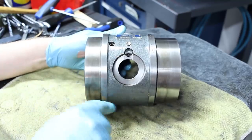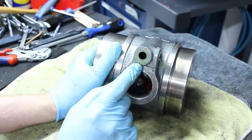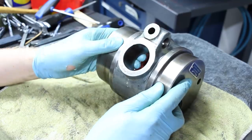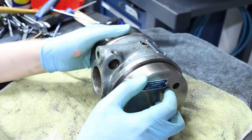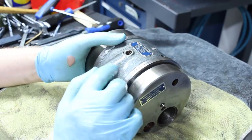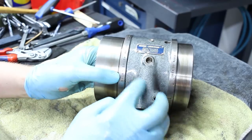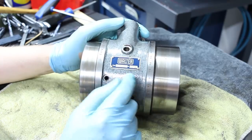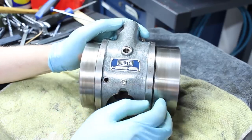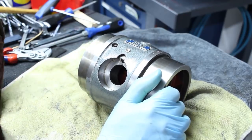The casting cleaned up nicely. The paint looks okay — I'm definitely not going to repaint this. What's odd is there's some green on here, some Reseda green, RAL 6011. Either the undercoat is this ugly green, or they were all painted green and then painted in hammer gray as per customer request. None of the grease fittings or oil fittings are overpainted, and the plaques and graduation are not overpainted, so it's probably a factory job.